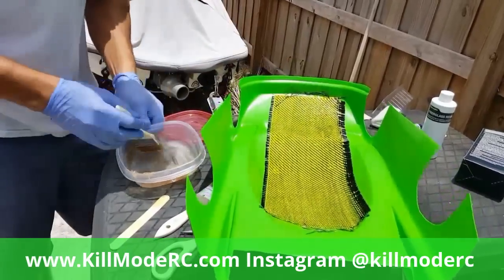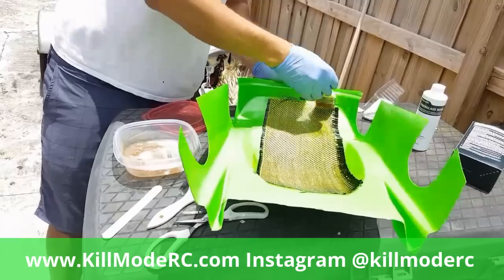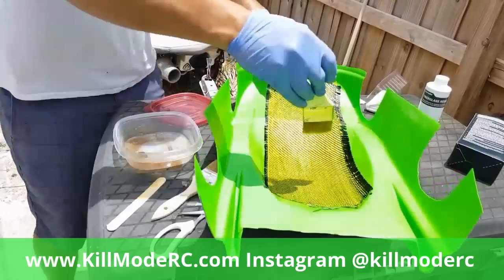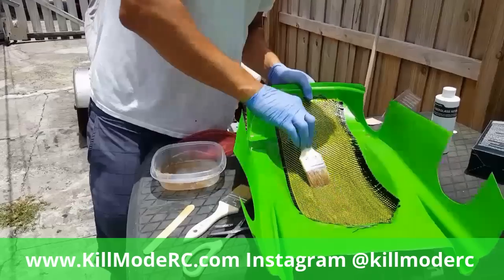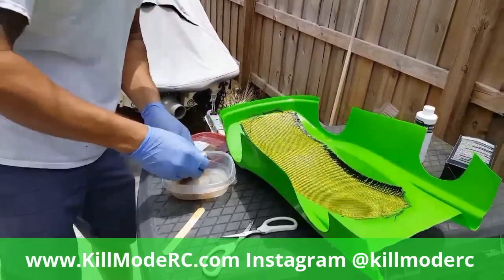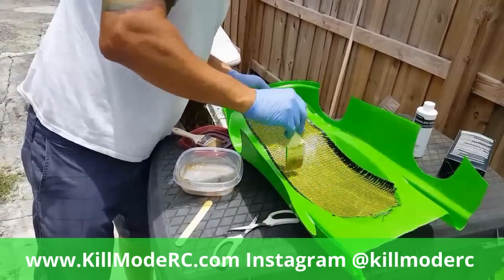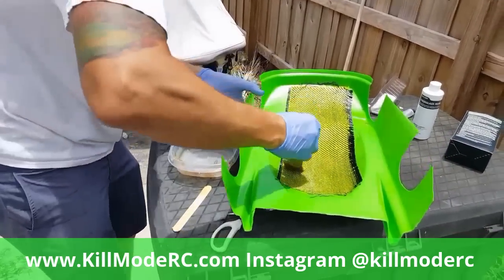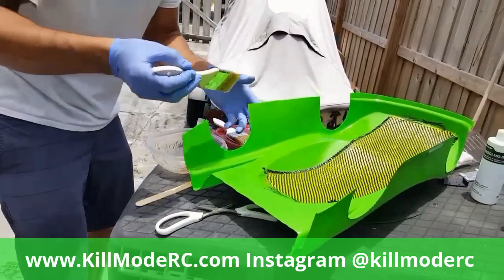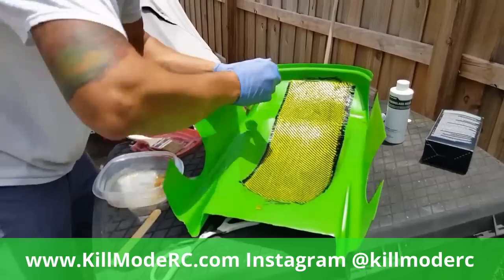I like the carbon fiber resin because it's considerably lighter than fiberglass, and once this is dry it's going to be a lot stiffer. Essentially what I did here is create a spine down the center - just like any animal has a center spine - and that's going to keep that body from flexing. I'll fill in the other spots, but I don't think you need every square inch of the inside reinforced - that's overkill and it'll just add weight. So on this one I'm just doing a nice spine down the center to make it really strong, with a strip here and a strip here.